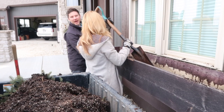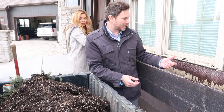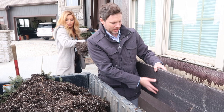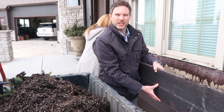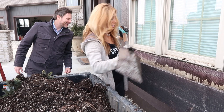For the back and the bottom, I used a wood composite — it looks like wood but it's a lot more durable. It doesn't need to be painted and stained as often. On the back and bottom was wood composite, and then on the front and the sides was a 1x12 cedar. That is stained, and with cedar, the front and sides will have to be replaced probably in a year or so. You can see there's already a little bit of cracking — that's just what happens with cedar. It's a soft wood and over the years it kind of disintegrates. It held up good for about 4 years now. He stands and admires his window boxes, while I do the dirty work.